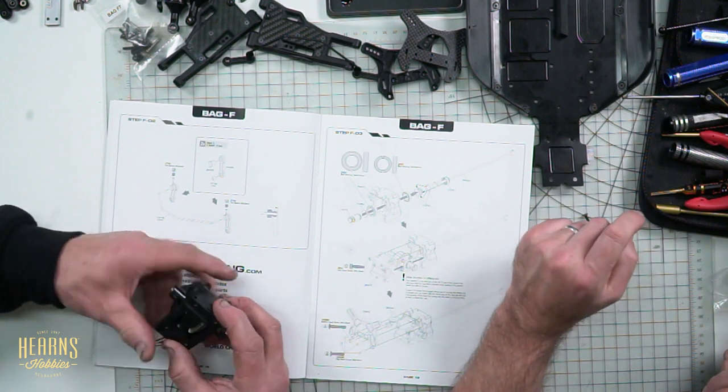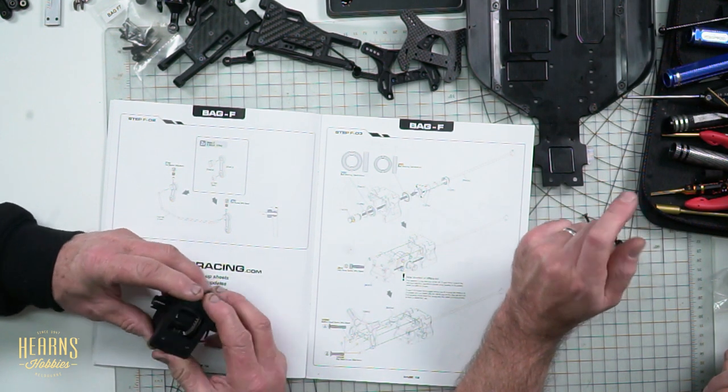Like I said, after day one, after about four batches, it's going to get a full strip and re-clearance anyway, because they do bed in an awful lot. I'm telling you now, the three shims is probably where I'd stay. Yep. You've got the gearbox, man. Well, no, it's still not right, but you can't add any more shims because it's going to flare the plastic out. So you need to bolt that in and see how it's going to feel. Absolutely.